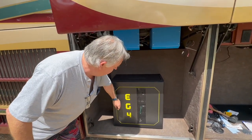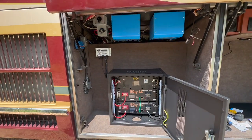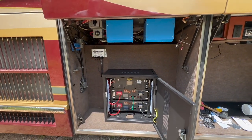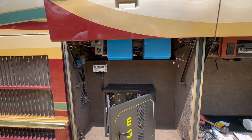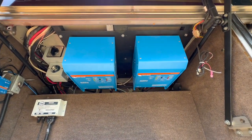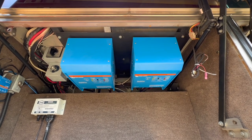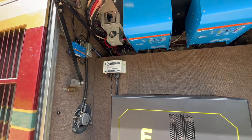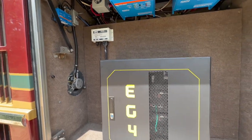Brand new, great upgrade. We've got three EG4s — those are 5,100 watt-hours apiece, so we've got 15,300 watt-hours of power. And then we've got two Victron MultiPlus — they're 24-volt, 3,000-watt, 70-amp charger inverters. And then we've got a WakeSpeed WS500 alternator converter to charge the batteries.